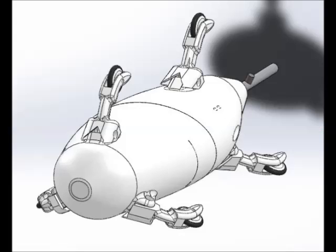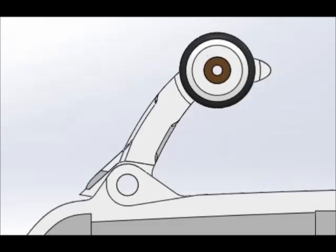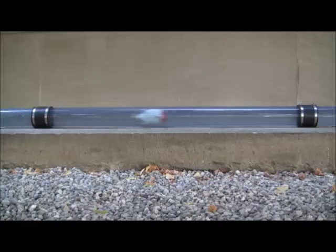The new design incorporated stiffer springs and a custom preloading method to ensure leg stiffness, even with slight displacements, as well as rubber wheels to prevent rotation and oiled bushings to minimize rolling friction in the forward direction. This gave the mobility platform the stability it needed, as well as an increase in speed and controllability.